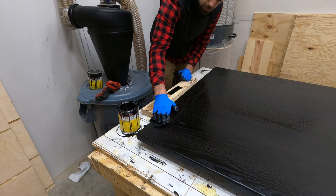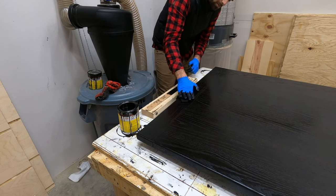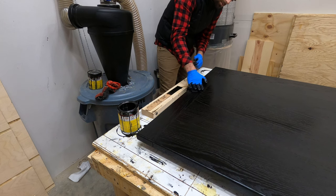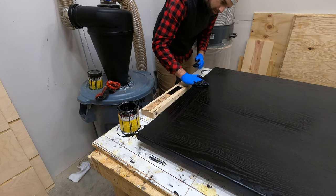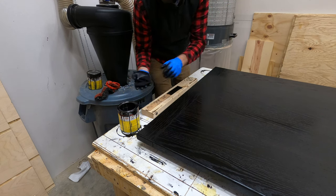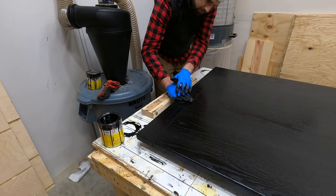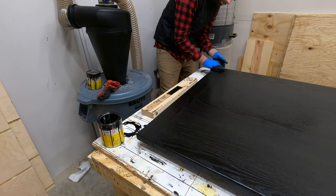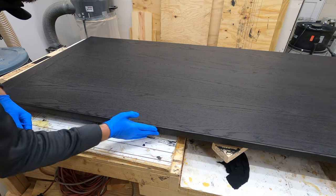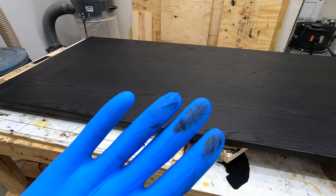In this shot you're going to see me mess up here where I stop my hand halfway through and readjust, which ends up leaving a smudge right in the middle of that smooth stain transition. If you do that, you'll unfortunately need to go back and stain over that in one smooth pass, just like I did here. Once you have all the surfaces wiped off, back away from the table and let it dry without any interference whatsoever.